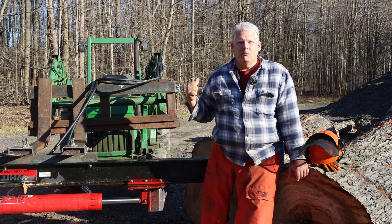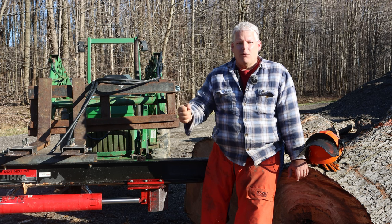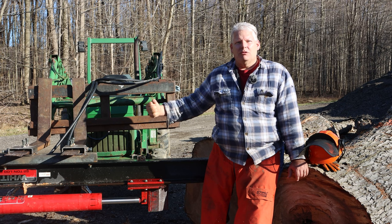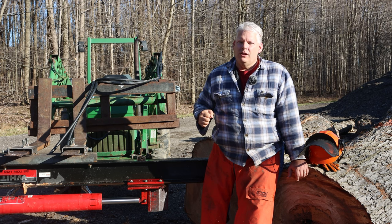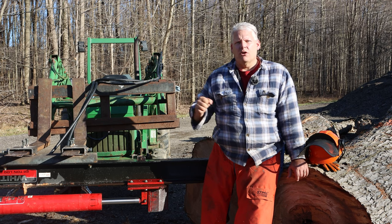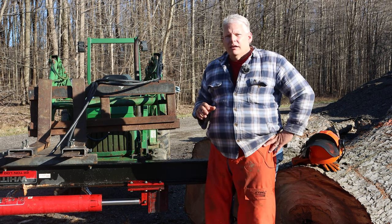The way I have it plumbed right now, and the way it works after an hour of testing and trial, is forward is split, back is retract, out to the right is lower the boom, in, which would normally be curl, is raising the boom. So I do have raise and lower function. It's almost like I'm getting bypass on the curl and on the dump mode of the valve. You know, lower and raise is fine.